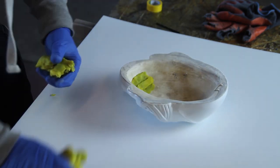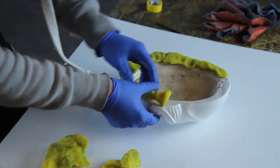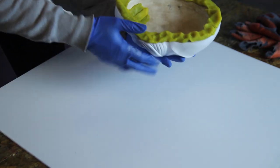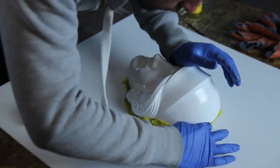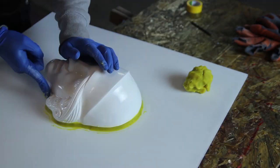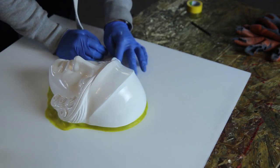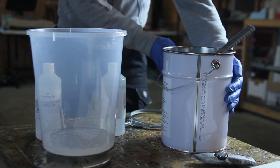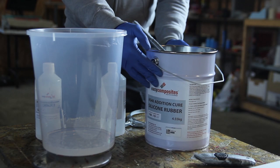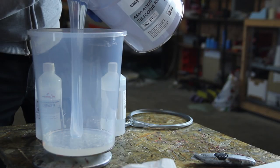To continue, we'll close some parts of the mask because we'll be pouring silicone on top. We have a base, and I've used some filleting wax to go around the mask to avoid too many undercuts — parts where the silicone might get trapped. For example, I've closed the mouth with some filleting wax. Now it's time to pour the first layer of silicone.